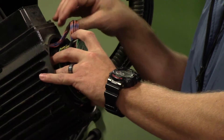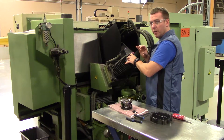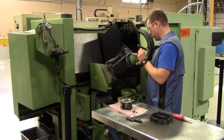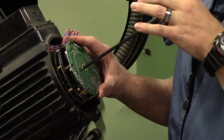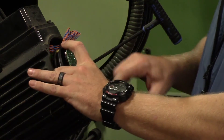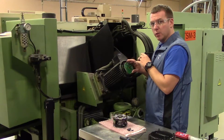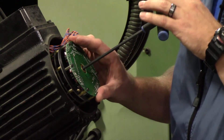Do your best to line it up and you'll notice a very big difference when it slides down. Then take the five millimeter Allen and tighten the center screw, making sure that the pin is in that hole. As you're tightening, don't overdo it because this encoder sits on a taper that's on the rotor shaft.